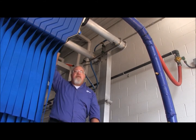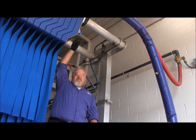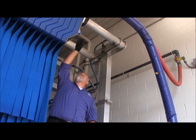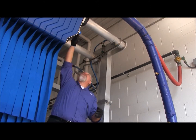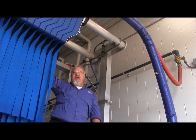On the other side of the basket, we have our other connecting bar and our other split collar and urethane style bushing. Again, we're going to want to look at the split collars in this area, our tie bar and our bushings to make sure they're in good repair and things are good and tight. Cotter pins are installed and bolts and fasteners are good and tight.